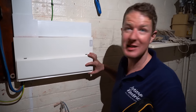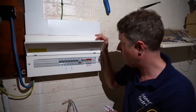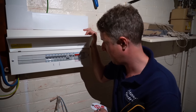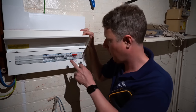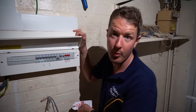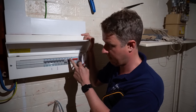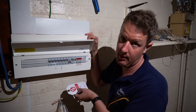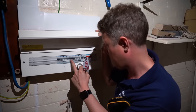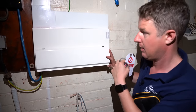It's a bit dark in here - this is the board and we have no lighting because this room isn't finished yet. We haven't labeled everything up yet, which isn't particularly helpful, but in a way it shows the process of figuring out which circuit does what. There's one breaker that's off - a little note: if you ever see a breaker that's off, don't just turn it on because somebody might be working on it. We're going to go one by one through these and turn them off until the kitchen sockets go dead.